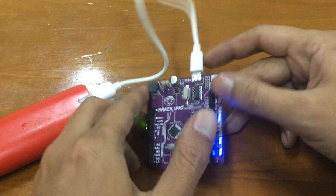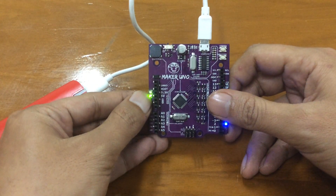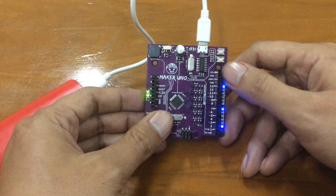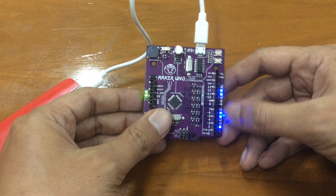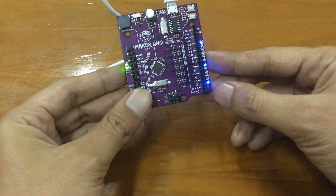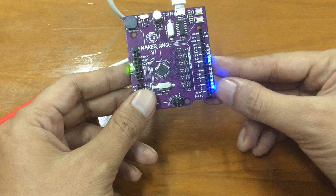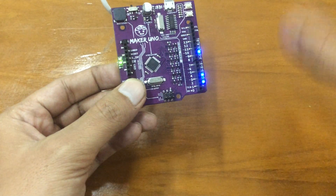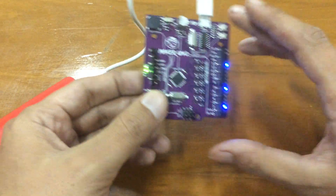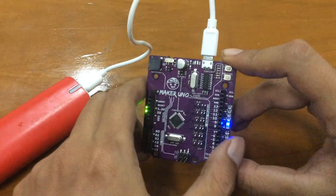As you can see, this is an awesome board. It has a power LED, 3.3V and 5V indicators, and LEDs for all digital pins — except RX and TX, which don't have onboard LEDs because placing LEDs there would make the serial connection a bit buggy.